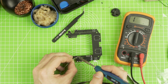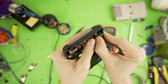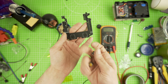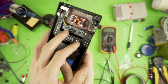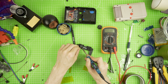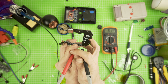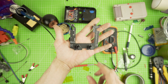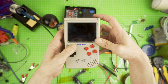Next is our USB port. Solder this one down and let's make a test fit to see if it all goes in place just right — and it does. All align perfectly. The last part to add is our buttons. Insert them in the PCB and add the plastic cups so we can try the feel of the buttons and the fit. If you are happy, let's go forward and solder the two buttons. Make sure that the buttons are flush with the PCB so you don't have the buttons misaligned. Check the connection with the multimeter on continuity to make sure it works perfectly — when you press the button, the connection should be made.